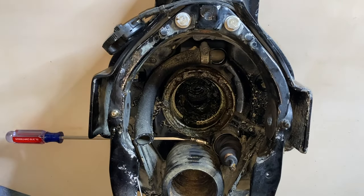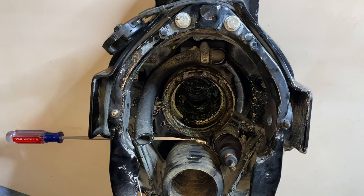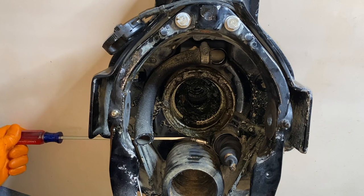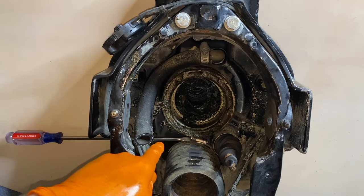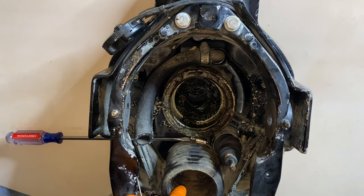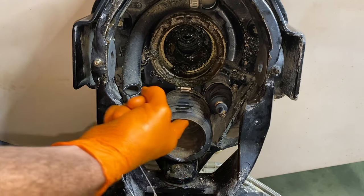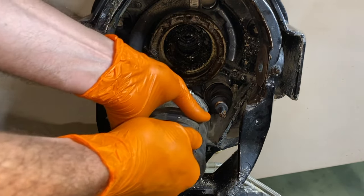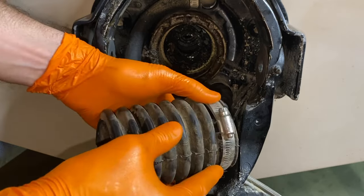I reinserted the long flathead Craftsman screwdriver in the access hole in the transom to show how it connects to the inner screw and clamp securing the exhaust bellow. Loosening it — the clamp is loose, but it won't come off easily because of the bellow adhesive. I'll use the screwdriver to break the bellow away from the housing, going inside to separate it as we did with the U-joint assembly. The clamp itself was very loose but the bellow adhesive on the rear side gives you trouble sometimes. Set that aside.